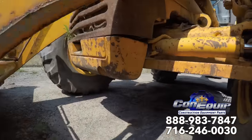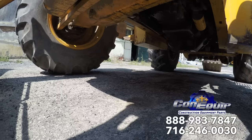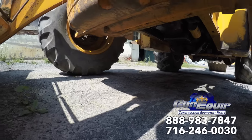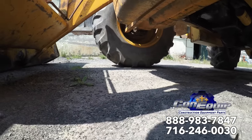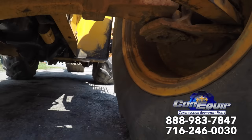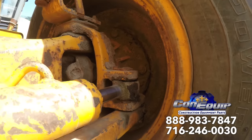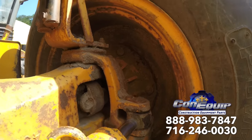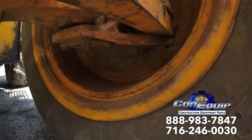That's a solid front axle assembly. Center differential doesn't look like it's leaking too much. I'm also looking at the swing or the swivels. The swivels are good and there's no cracks in the swivels. Tie rod ends and steering cylinders look good. You got to check that over - that stuff can get expensive.